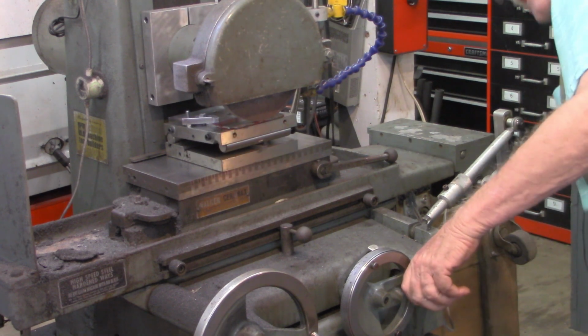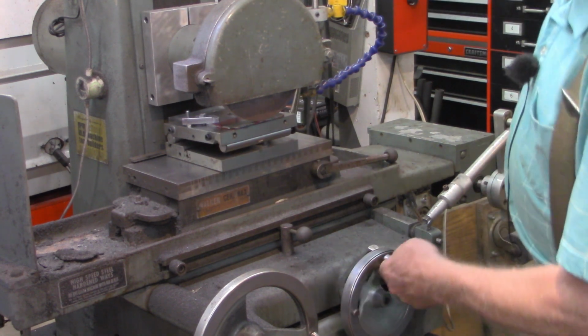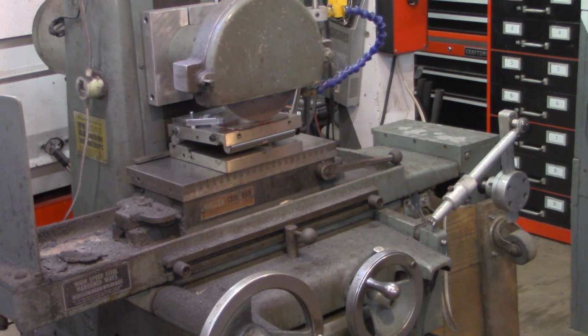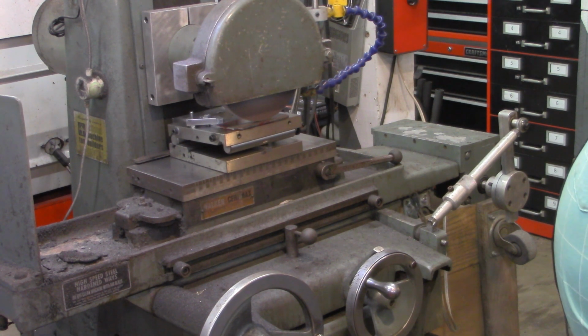Now that's as far back as I can go. I like to pass the whole wheel over an item, but we'll see how this works. Everything's clear. Give the surface grinder a couple minutes. I've already had it powered up earlier this morning, dressing the wheel. But I want to give it a minute or two running now to let the oil circulate.